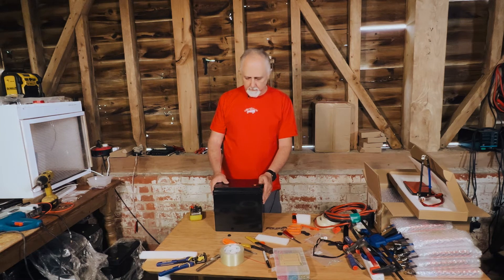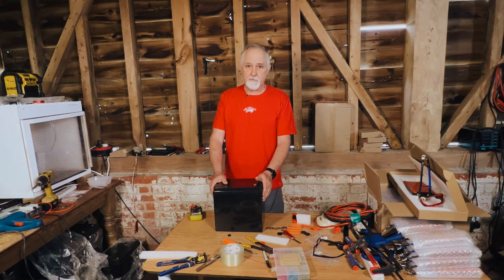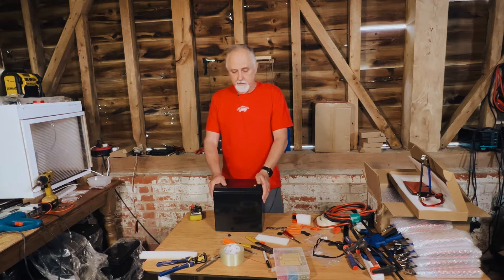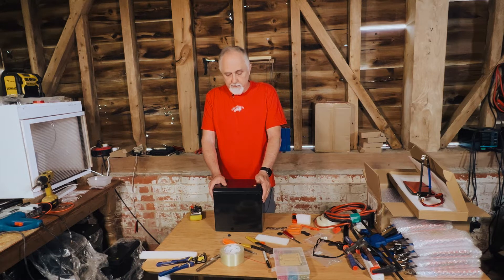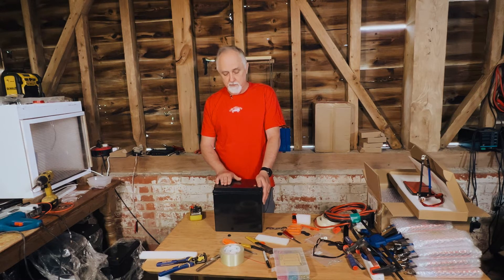These are quite amazing little batteries — 105 amp hours, so let's call them 100 amp hours, but that is 100% usable power. A lead acid 100 amp hour gives you at best 50%, so 50 amp hours. Quite a lot of recent studies have shown the amount you should actually use from lead acid is close to 40%, so two 105 amp hour lead acids still doesn't give you as much, and two of those would weigh approximately 45–50 kilograms.